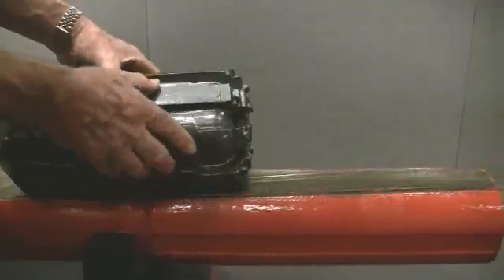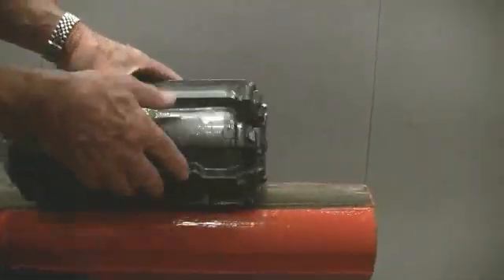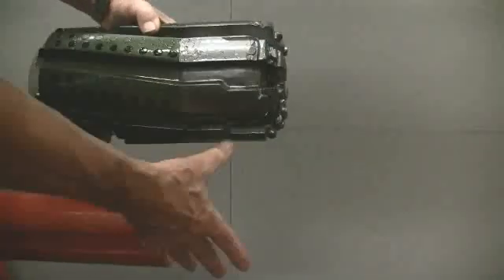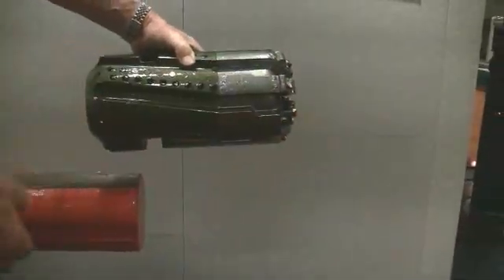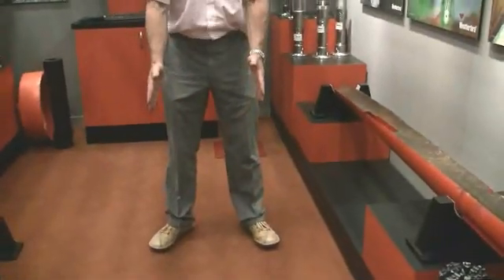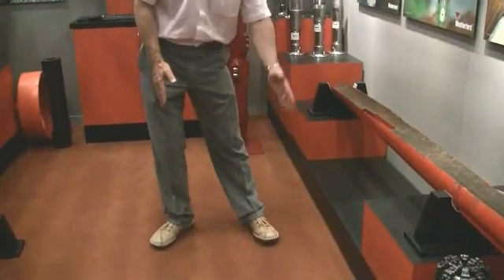I keep drilling. I'm now getting a lot of formation, and finally I'm drilling new hole alongside the old hole and getting 100% cuttings back. So now what I have succeeded in: I have two wells diverging downstairs like this. I can now continue drilling my new hole to the depth I require. Ultimately I will retrieve the whipstock and I have two usable holes down below.